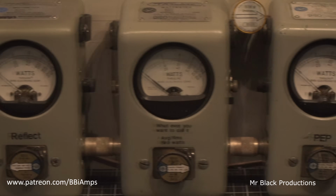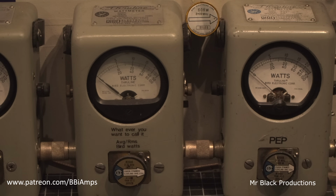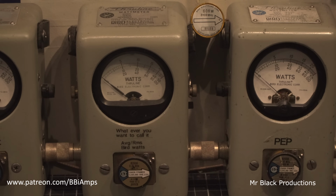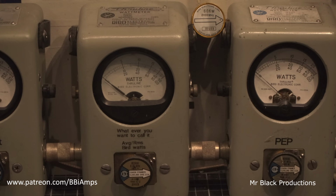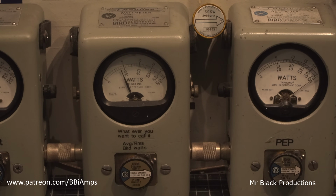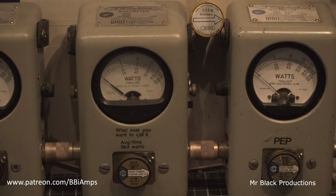Same as before. It's a 5-watt slug in reverse. We're seeing about 1/4 of a watt swinging back. We've got 1 bar showing on the SWR bridge on the Striker. Hello. And that's laying up against the stop peg.